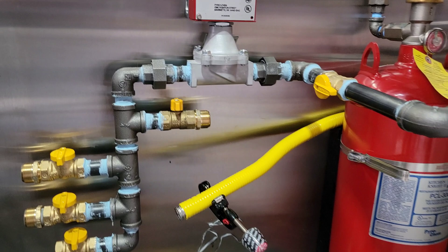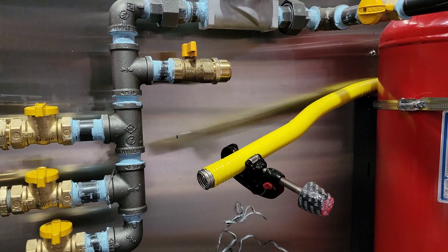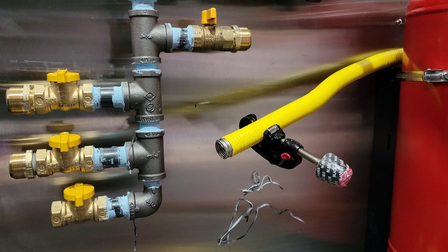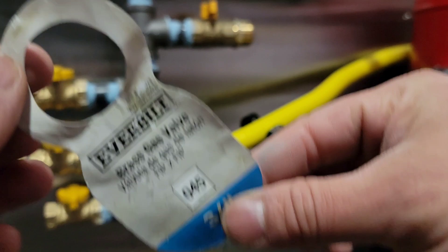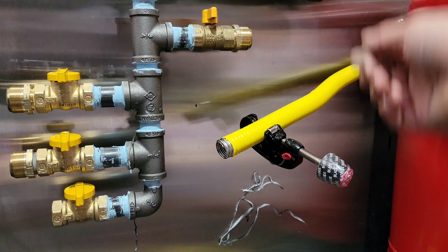What I have here is a flex three-quarter-inch flexible propane line made by Home Flex — I bought it at Home Depot. These are the connectors you buy separately; this one is a three-quarter-inch male. I also added a brass gas valve — almost like a shutoff — on every single exit, as an emergency shutoff and a safety precaution.